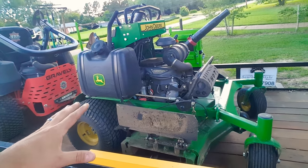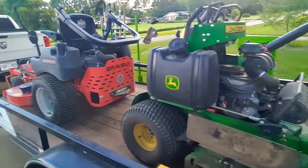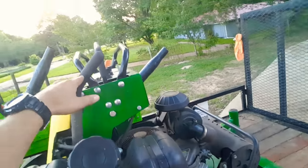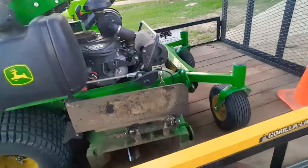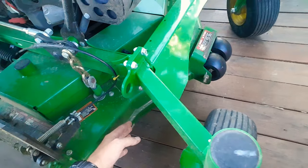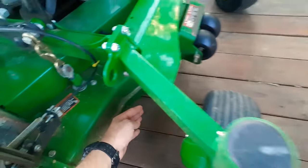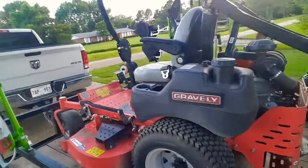Once you get used to a stand-on, it's almost like you're dancing on the yard — just leaning into turns, it's so nice. Now the downfall of the Gravely is it has a foot pedal and you stand behind the wheels. With the John Deere I can drive with one hand and feather the deck if needed. I've also found that the wheels ride so close to the deck that roots I used to scalp with the Gravely don't get hit, because these wheels basically act as big anti-scalp wheels.